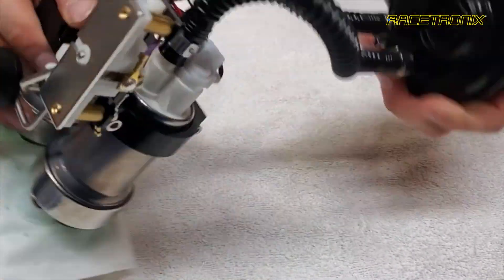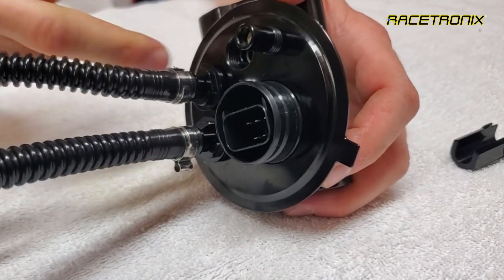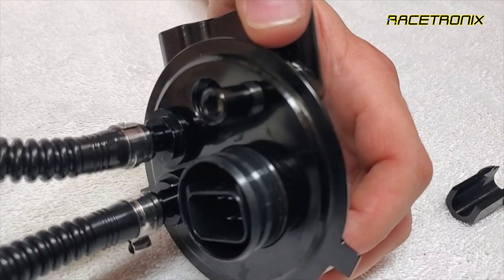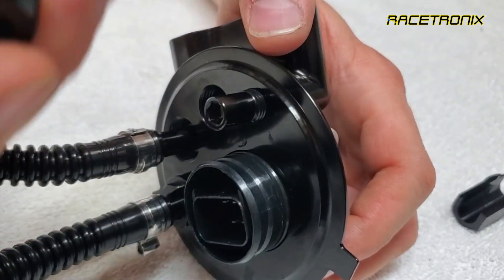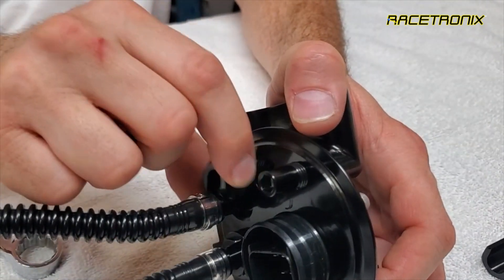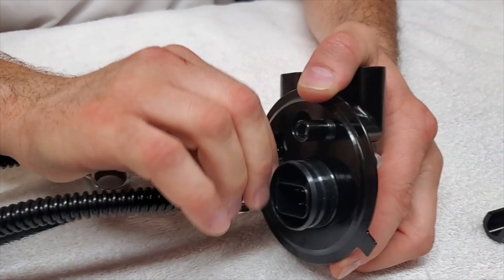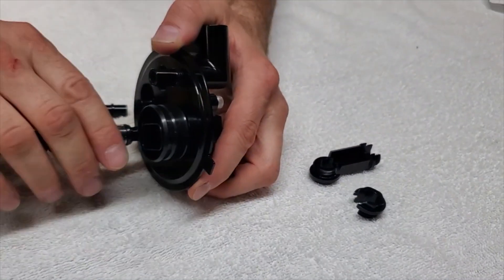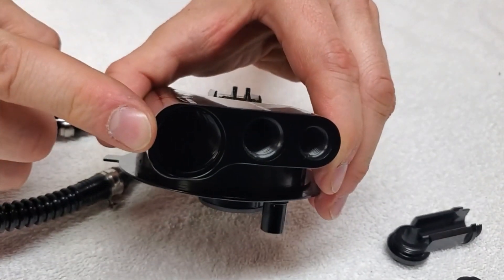The next thing you want to do is remove the crescent locks from the quick disconnect fittings for the fuel tubes for the pumps. These also use a 5/8 wrench. There is a hex on top of the crescent locks — you simply put the wrench on there and rotate them until they're loose, then unscrew them by hand. They have a relief cut in the side and will slide on and off the fittings. These also use double O-ring seals that go into the discharge port for maximum flow.